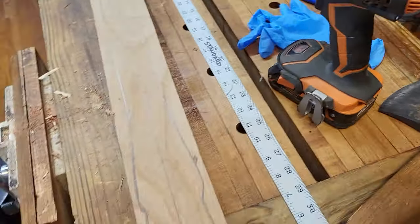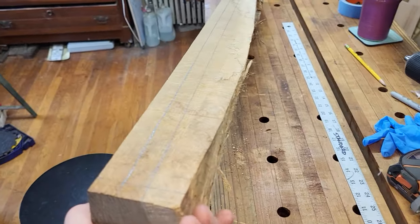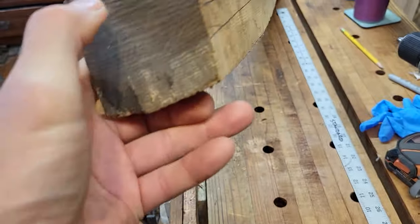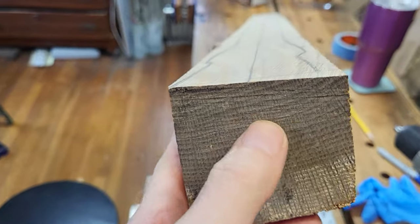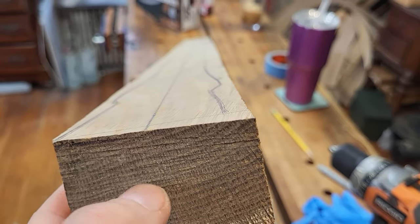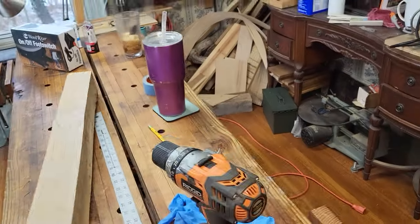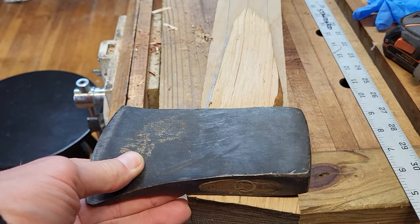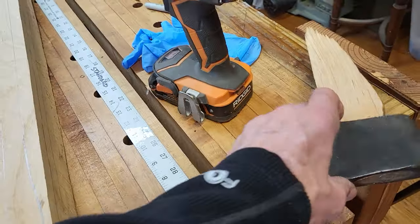So what I did was I went out in my outside shop. I'll get you in the tripod in a second. And grab myself this piece of white oak that's dry. It's got a perfect grain direction, which is going to be vertical, slightly rift. So slightly at an angle from corner to corner along the length of the axe, with the heel being over here and the axe head over here in this configuration. So in that configuration, what you really want is you want the grain running.